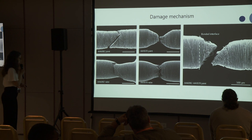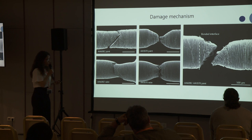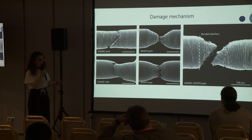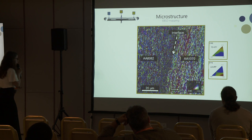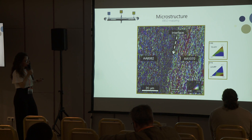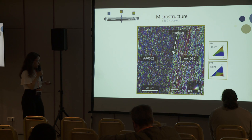From these tests we could also get a close-up on the fracture surfaces while the tests were happening. If we focus on the mixed joint — the 6082 towards 1070 — we see that not all of them broke at the interface. We were wondering why here and not further down in the bulk material. So what we did was an EBSD mapping across the interface.